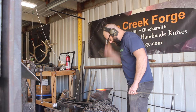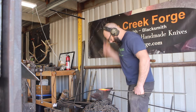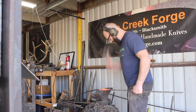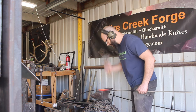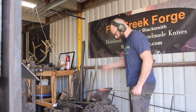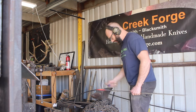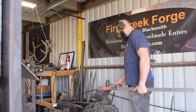What that method does is spread the steel out on one side of the blade. In this case I'm going to be forging on both sides of the blade — on the spine and the edge, unequally of course — but close enough to keep the blade pretty straight, and then simply tapping it to straighten it out on the anvil. It's not a big deal.